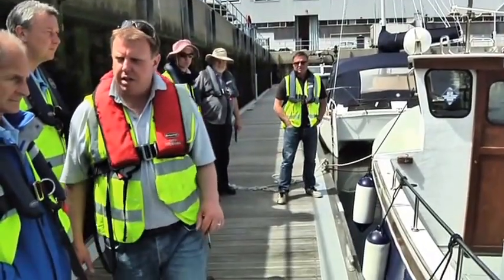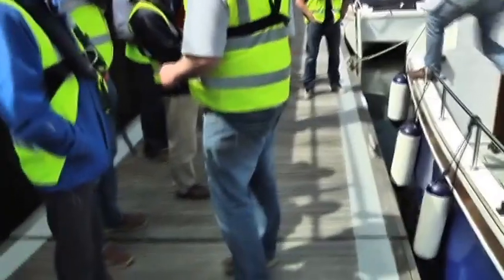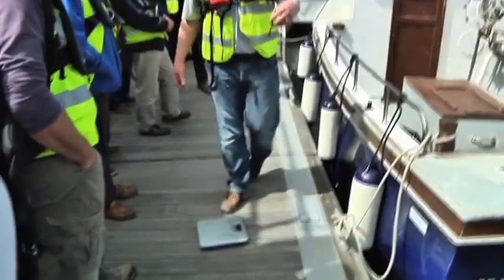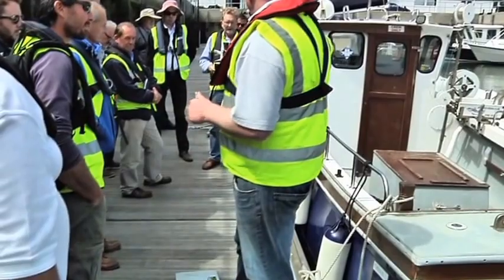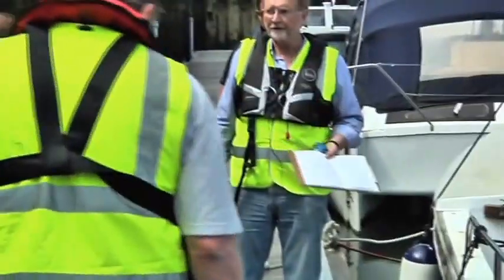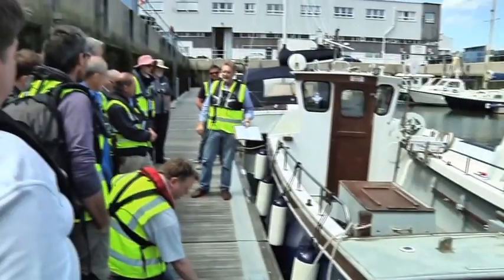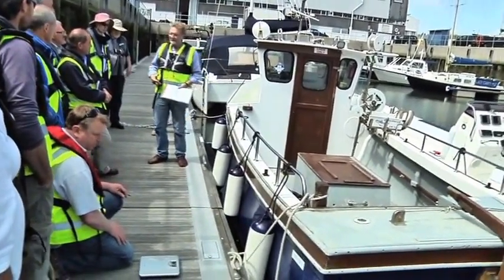Let's have 6 volunteers. And what we have to do is we have to weigh you all off. So if we're still working to the 75 kilos, if you're 100 kilos, then we've got 25 kilos in the bank, haven't we? If this was a boat with a continuous straight through deck, its required minimum freeboard would be 300 millimetres. And we're getting 870 one side, 820 the other. So it's probably not quite so crucial on this boat whether we measure to the nearest millimetre or not.